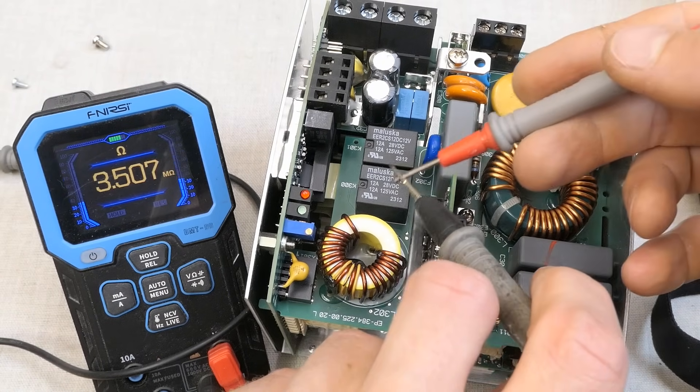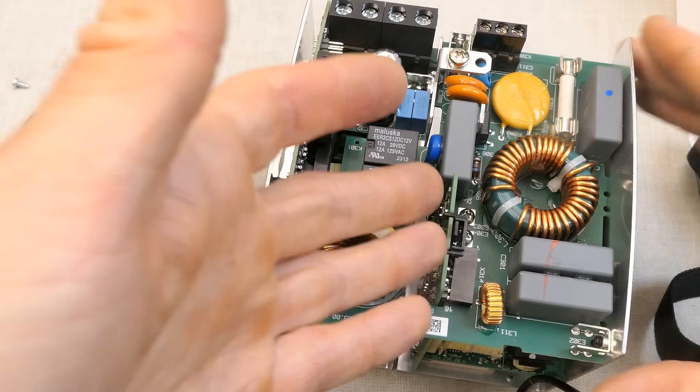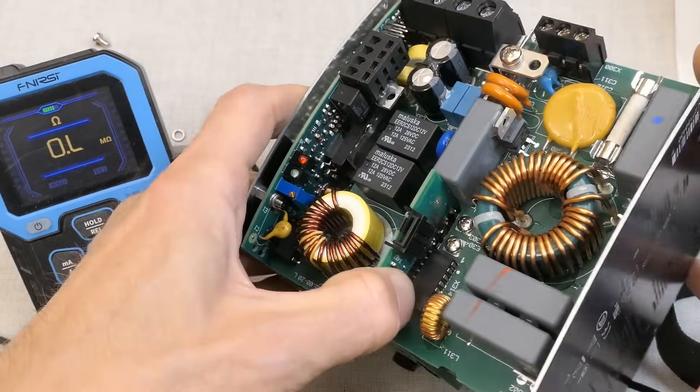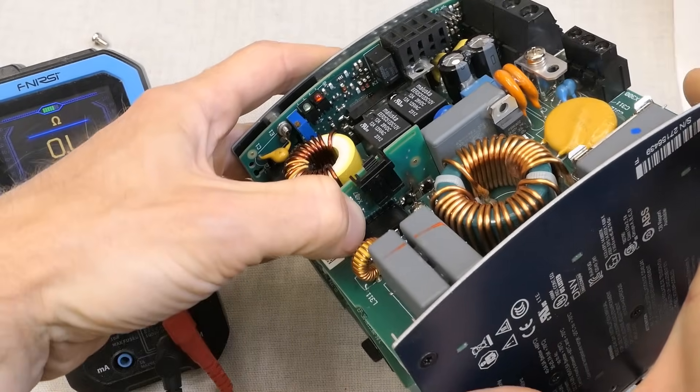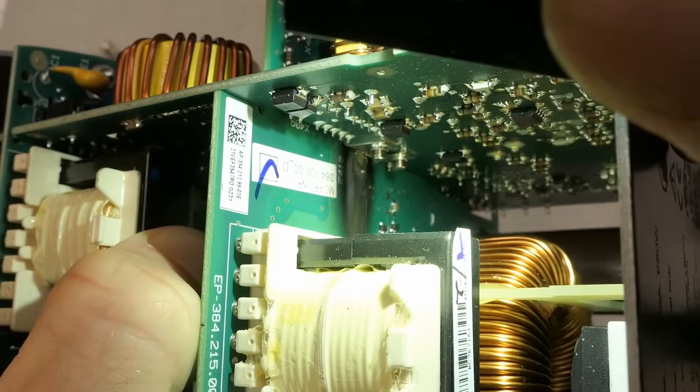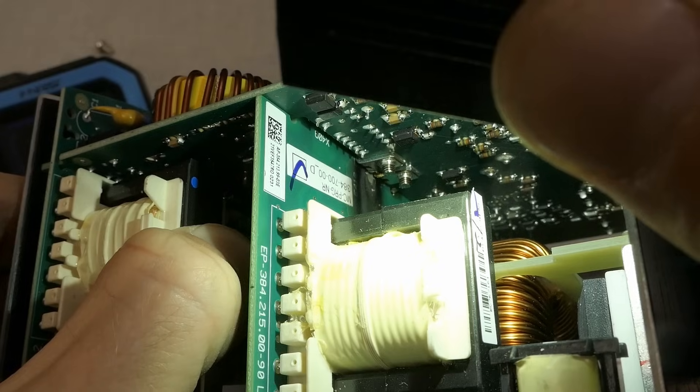The meter is using a low voltage of less than one volt. It might have arced over at a higher voltage from the mains. Was this arcing started by a failing component, or was it just board carbon tracking? I don't see any component here — I have to disassemble it to see it better. The epicenter seems to be between the terminals.